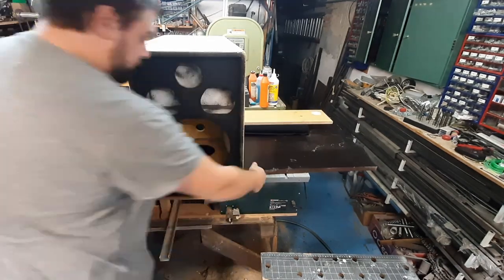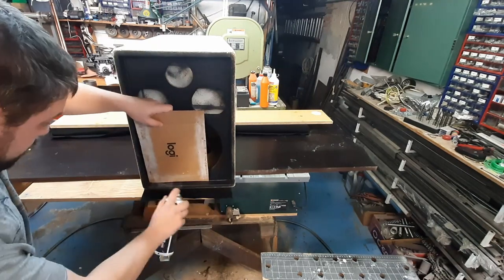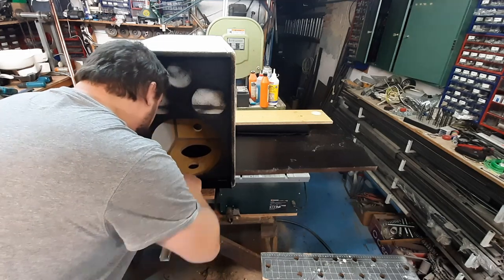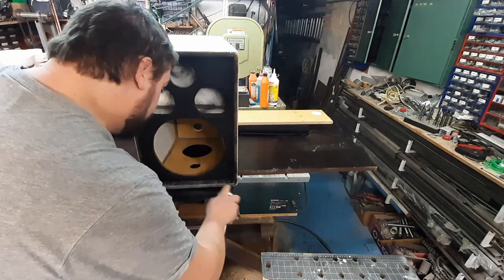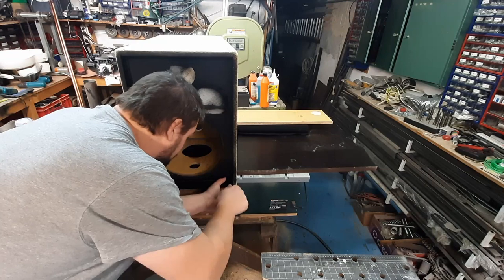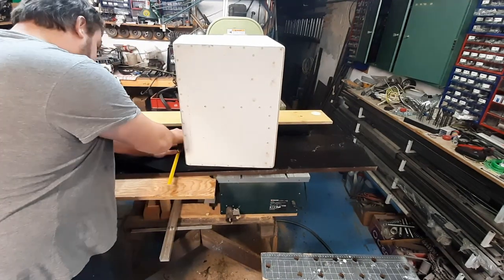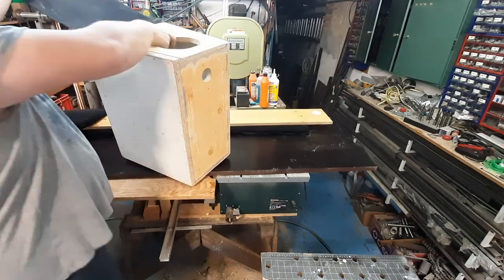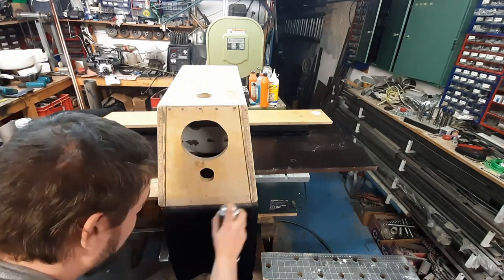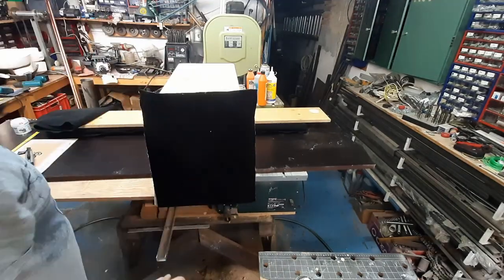It's very unusual, but it did happen, and this speaker really had this characteristic. It resonated in a ported box lower than it should. It acted like a speaker with higher mass and much smaller effective area. The sound was like if a port vent hole was covered, like the air rushing sound. I was prepared to junk the whole speakers, because these were made specially for the woofer, and it would be difficult to adapt them to some other speaker. And it wasn't easy, but in the end I've compensated with a bit of acrylic clear coat, and I've clear coated the membrane, and that solved the issue.